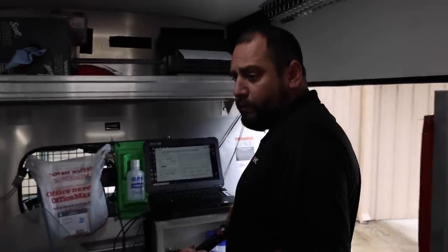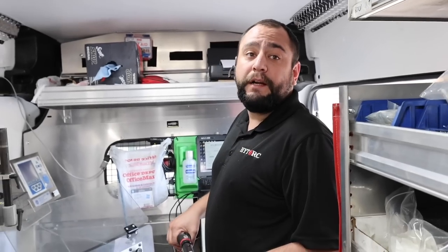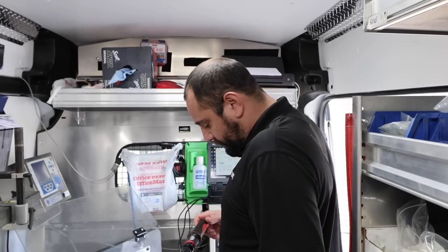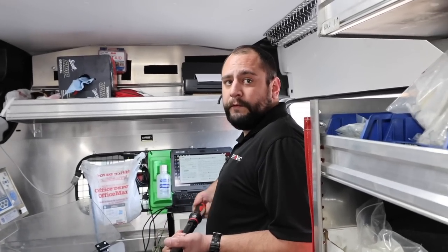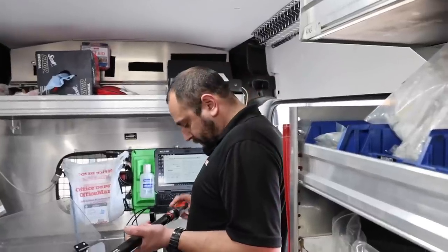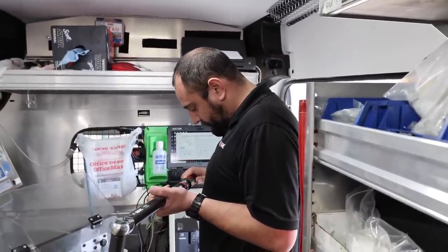And it all depends too where you put your reaction point placement on the wrench. You're supposed to test it dead center on the wrench with the wrench being level. So depending on where you're pulling on it, would change the number significantly. Okay, so it was registering 228 on 240, so that's still within tolerance. Should be. It would be roughly 10, so we're a little out.